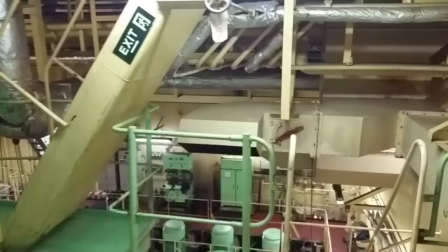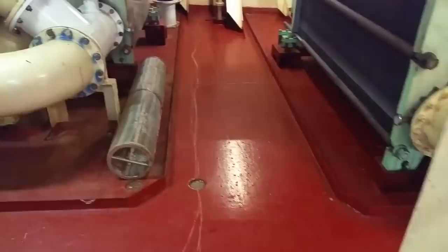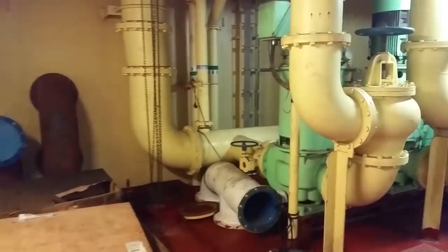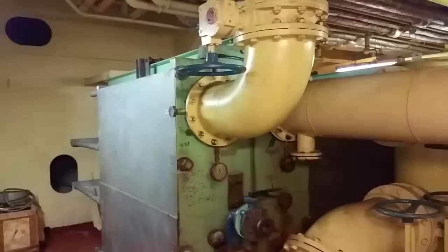The next deck down we're going to see some coolers — lube oil LT coolers. There's a feed water tank and some cooling water pumps. These are the LT jacket water coolers — there are two of them. Salt water goes in and out, which cools the jacket water from the main engine. In port when we're not running, you need to keep it warm — that's what that heater upstairs was for. There are two coolers; if you're in a really hot place you might need both online.